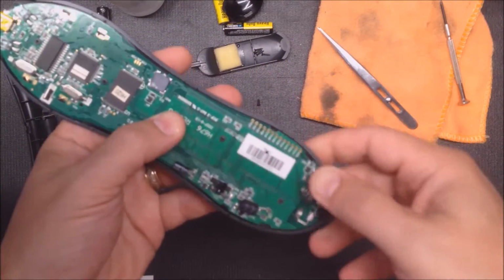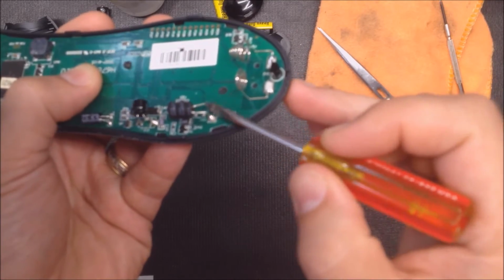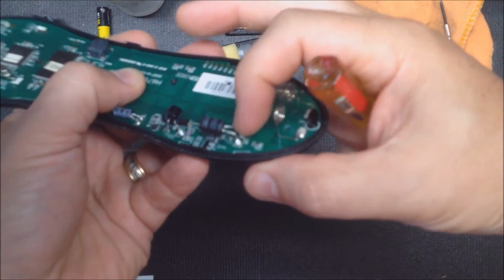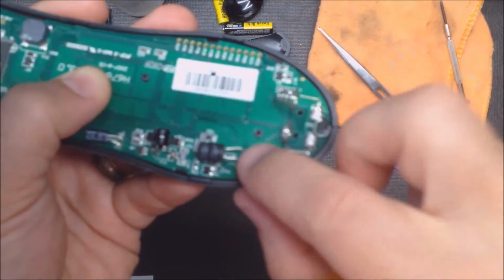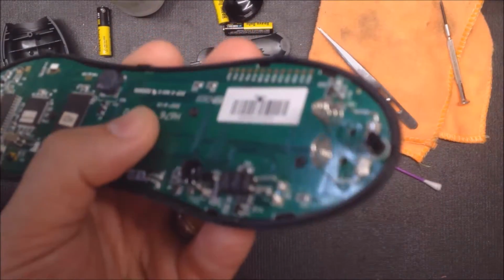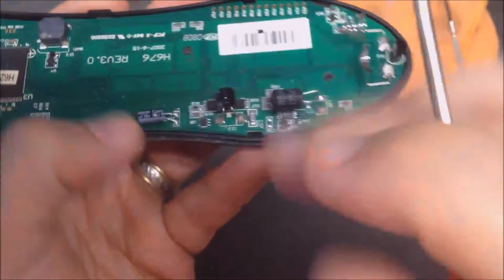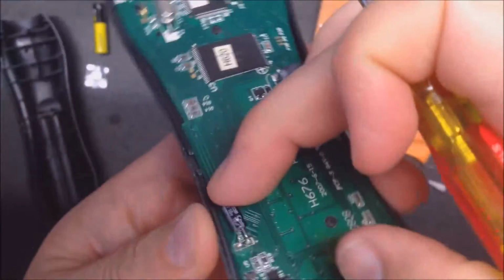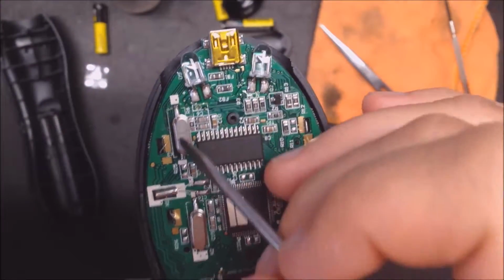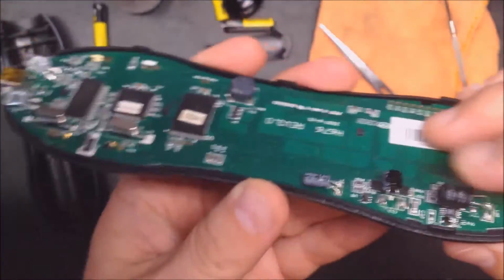And one thing I want to point out to you, I had this thing break on me. There, it can move, and it could break from drops, or you hit it and it could break, and you'll have to resolder. If something like that happens, you'll have to, let me focus this in. Yeah, you'll have to resolder them on there. You got another part here, this one. Any of these with big things that can move with leads has a potential of breaking. So if you do have some major problem with your remote, you might want to check those out first.